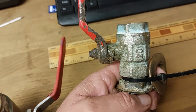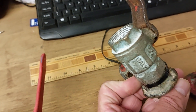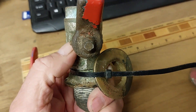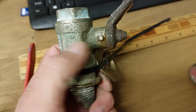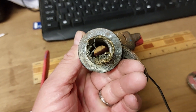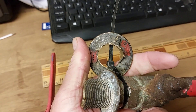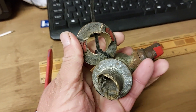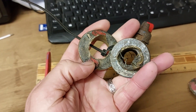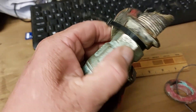This one came from an argument where I told the owner the valve was at least 15 years old, from a French production boat, and I thought he ought to change it. It's made in Italy, looks pretty okay, and he was a bit cross about it — but it was dripping and didn't look right through the gland. Anyway, he went to put a spanner on it to take it off and actually pulled it through the bottom of the boat. Here's the external tail skin fitting — look how thin the walls are. How do you know, as an owner or surveyor, when it's going to fail?